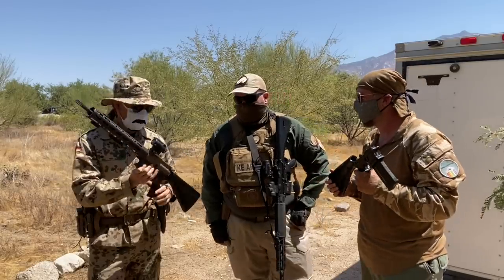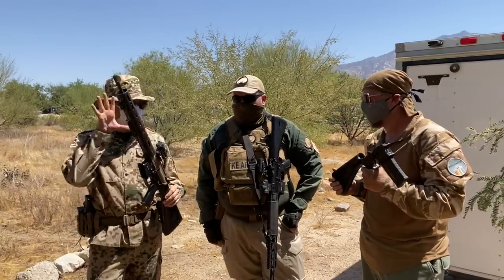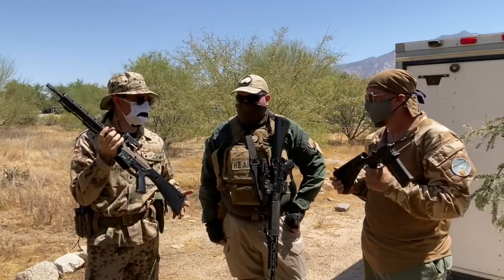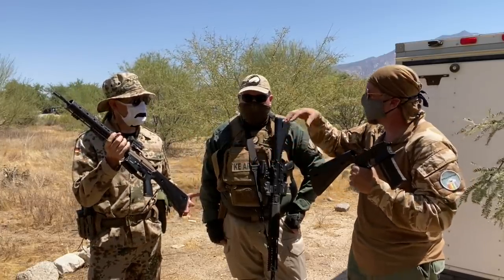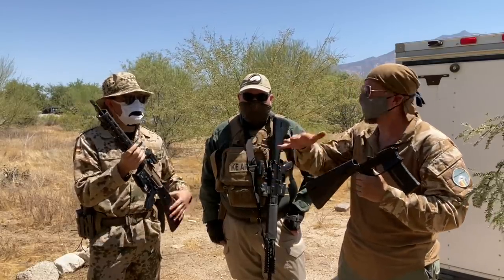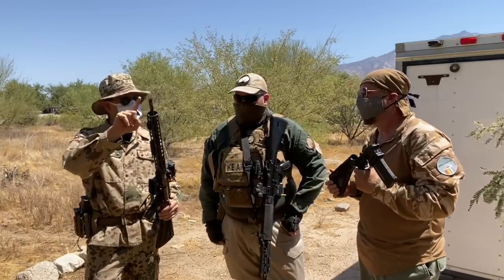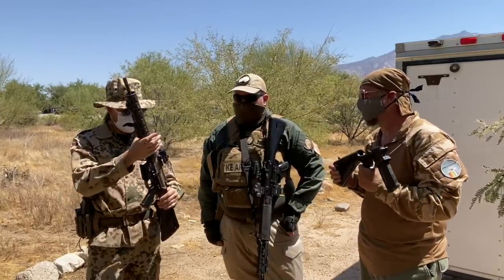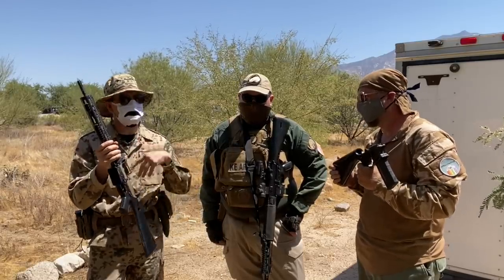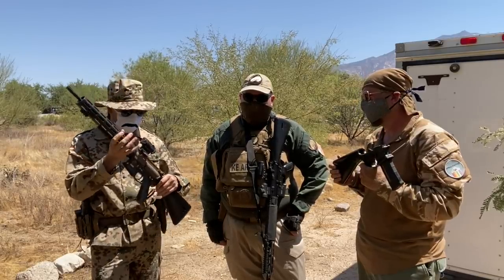So what I actually did is I took my 2017 What Would Stoner Do? and just pulled the upper off of it and dropped it onto the 2020, the KP15 lower. So this is the closest thing we're going to have on today's field of fire to a 2020 What Would Stoner Do? But it's not representative of the ultimate 2020 carbine. So there are a few changes. The barrel and the muzzle device are going to be different on the 2020. These lowers don't have PDQ levers in them yet, because that's an extra step of complexity that we didn't want Russell doing by hand with a file.